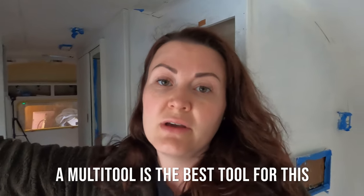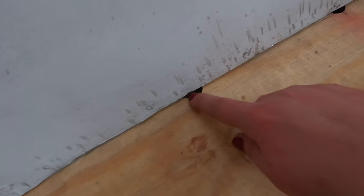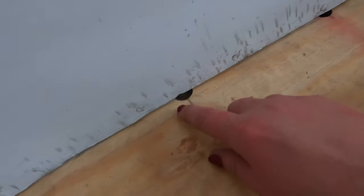If you're just doing some repairs, what you want to do is remove the parts that need to be repaired and then clear out that c-channel. There's going to be wood from the subfloor in that c-channel. You need to free all of that wood, and when you are cutting and fitting a new piece, you need to make sure it will go into that c-channel. There are bolts you're going to have to cut around — you do not want to cut those bolts. What our guy's been doing is cutting a little half circle with one of his cutting tools, and as you're sliding the piece in it just goes right around those bolts.